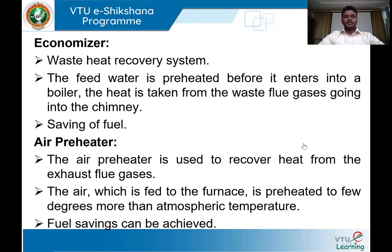The air preheater: air is needed for combustion of fuel. If it is possible to preheat the air to a higher temperature than atmospheric, there is an advantage — the energy that would have been used to heat the air from atmospheric temperature is saved. We make use of the waste heat from the hot gases let out into the atmosphere to preheat the air before supplying it into the furnace. Using the air preheater, along with the economizer, results in saving of fuel.